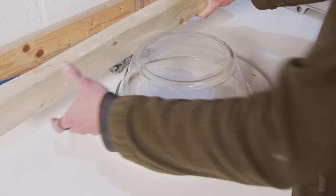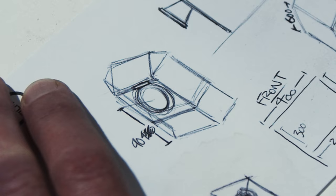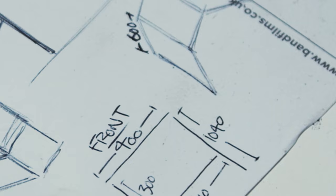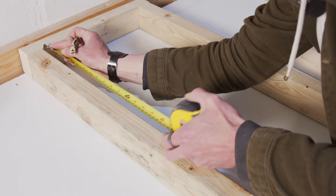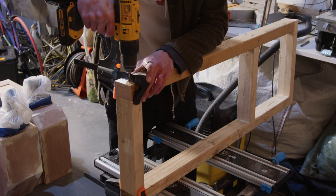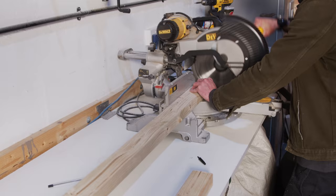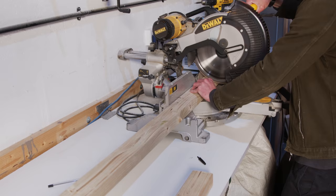Anything I make starts with a drawing, and in this case, a washing machine door. This is going to be our porthole. I start by taking measurements and building a frame upon which I can attach it using the hinged bracket. Once I have my measurements, I drew up the rough plans for my basic frame. I made a list of all the lengths of two by four I needed, then cut and marked everything. No fancy joints here - I just use bar clamps to hold the wood together at the joins, drill pilot holes, and then follow them with screws. I built the chair first so I could use that as a reference for the height of the porthole, as well as the size of the cockpit overall.